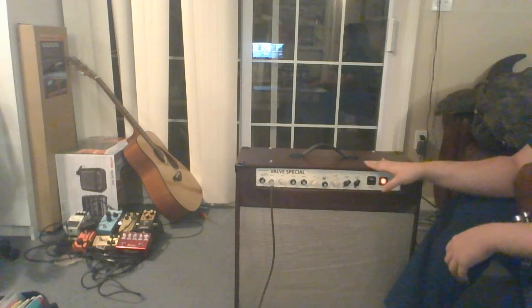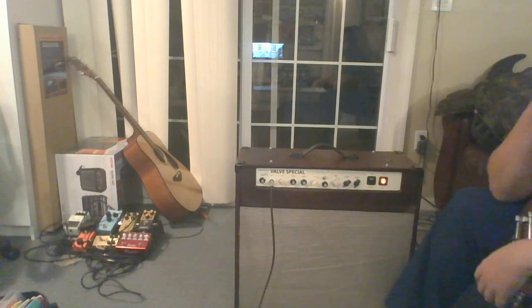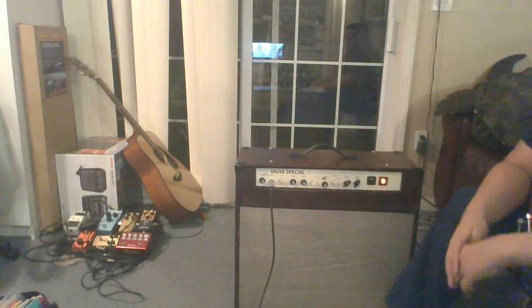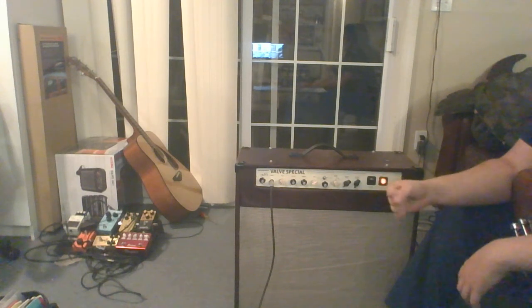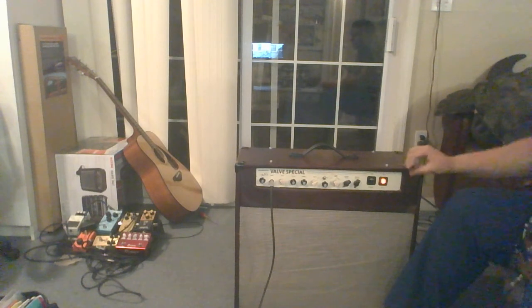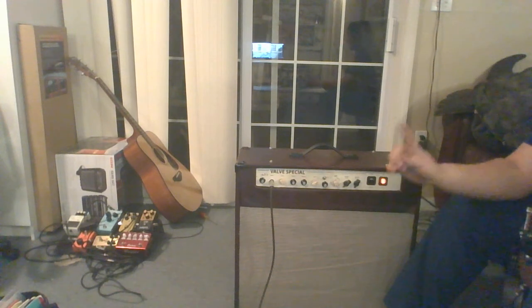But the number 34 is based on that with one less triode. So it's not as gainy, although it can get similar tones. I decided to make this version because I tried making the 4-gain stage version and it's just too much gain. I think it's unusable, and I don't know how you can use it without getting wicked squeal, because even this can squeal and this has one less gain stage.